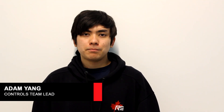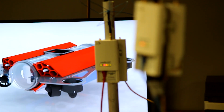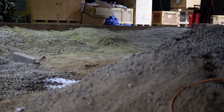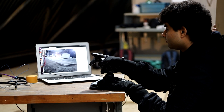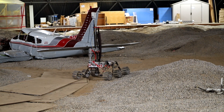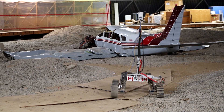This year we have gone with a modular, peer-to-peer-based control system. For long-range communications, we utilize a combination of 900 megahertz and 2.4 gigahertz radios connected in parallel. This allows elements of our control system to be hot-swapped between links, providing fallbacks in case of catastrophic comms loss. This ensures the reliability of drive commands while maintaining the ability to send a large amount of data. Our cameras utilize a low bitrate WebRTC transport system, which transmits a tested 6-camera feed simultaneously over our current communication system. WebRTC-based connections provide us with low latency feeds in addition to high levels of encoding, giving the driver a complete picture of what is going on without saturating the current rover throughput limits.